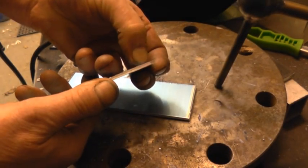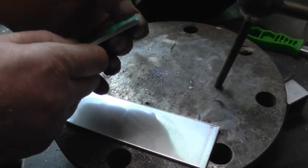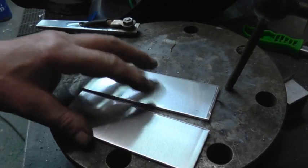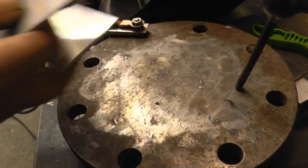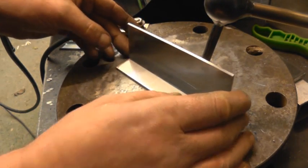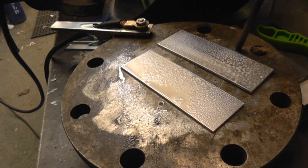We've got some 3mm plate here. We'll try some welds on that, see what sort of settings I'm going to need to get decent results. It's brand new, nice and clean, and all I've done is give it a wipe with acetone or panel wipe just before welding — it makes a big difference. I'll set it up again, it's a straightforward T-joint. I've got some anti-spatter spray — I'll give it a try, can't do any harm.